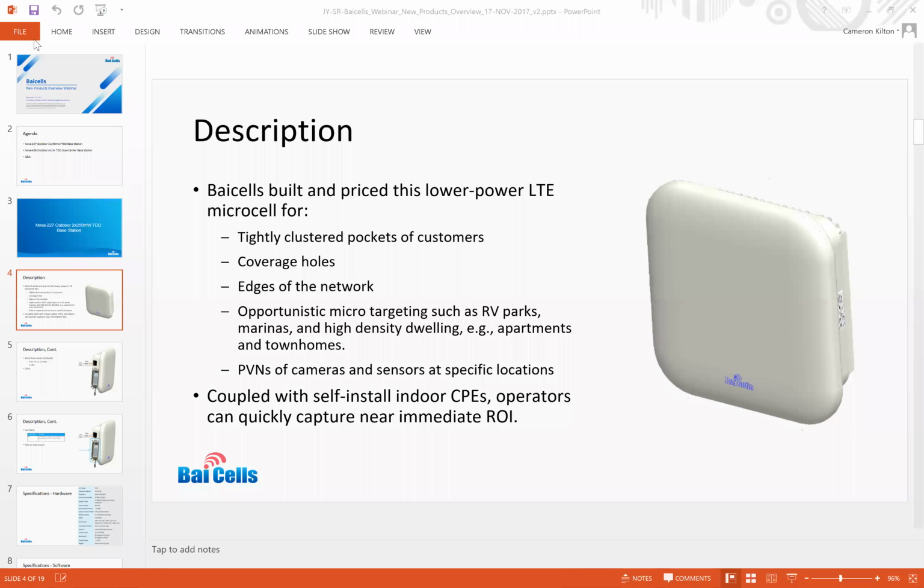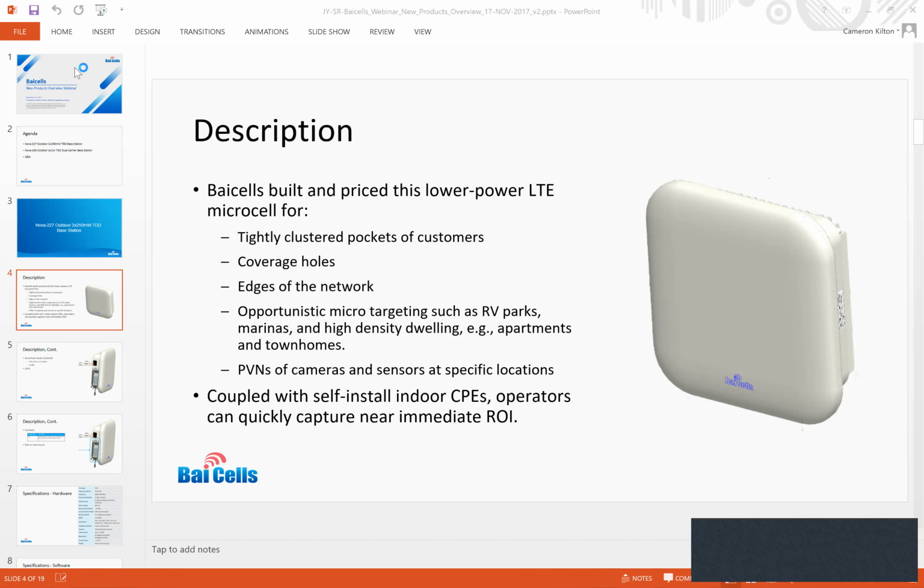So we know a lot of people are using different technologies now, whether it be Mimosa, Ubiquiti, MikroTik wireless solutions, or Cambium, etc., to fill some of these micropop voids. And we wanted to develop a product to take that away, per se. The reason we did that is that it's much easier from an installation perspective to keep one part number on the shelf, regardless of whether it's a micropop or a full-blown tower. With LTE, at least, it doesn't care. As long as you've got a SIM card in it, it's going to connect to whatever base station it sees fit. That may be the micropop, or it may be the macro right on the tower. So we have the opportunity to really leverage standards-based LTE while still maintaining much simpler inventory control for your installation technicians. And as long as they get a signal, they can get going.